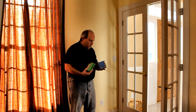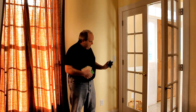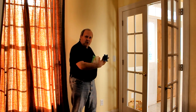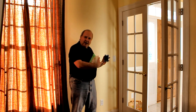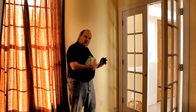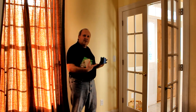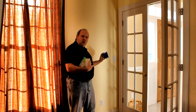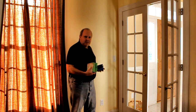Why does that occur? This is a box that gets put into the wall — a more modern one and a plastic one here. When they cut the drywall in, you can have space around the sides of the box that are open. There are big openings in the back that you knock out to allow the wiring to come through. So that goes through the drywall, back into the insulation, and depending on how that's all fitted around there, opens this box up to the cold air hitting the exterior wall of the house, kind of getting behind the insulation.